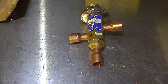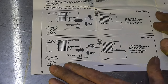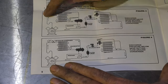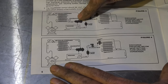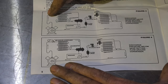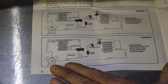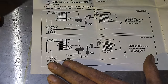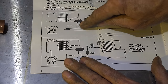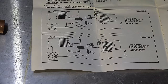Now I'm going to show you a diagram — it comes with a kit on this thing. Looking at these two figures: under normal operating conditions, hot gas comes up here. There's a tap that goes over through the bypass, but this is closed off because the outside temperature is high enough. So the refrigerant simply goes through the condenser, into the bottom, and out this port to the receiver, and it acts like any normal refrigeration system would.